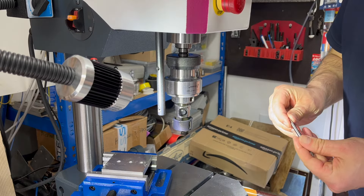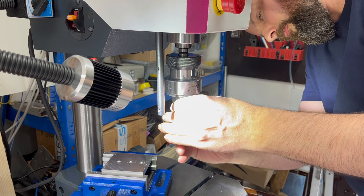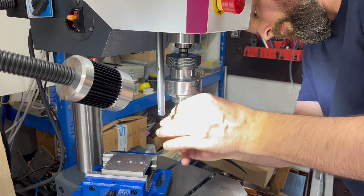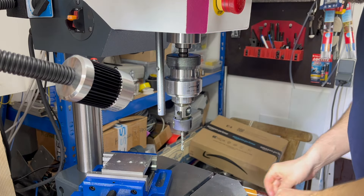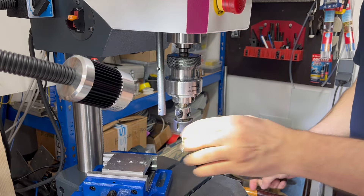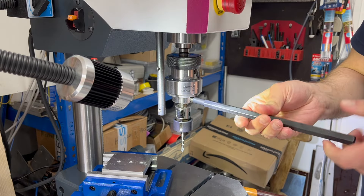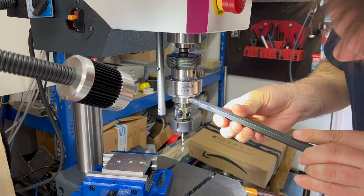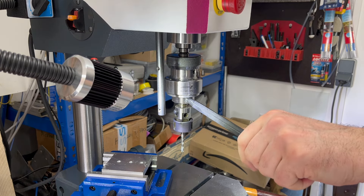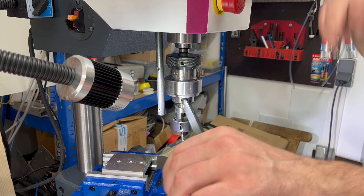Next comes the thread tap — this is a blind-hole thread tap, but of course you can also use a thread tap for through-holes, that's not a problem. It has a relatively large range: with this adapter, from M3 to M12, all thread taps can be clamped. The keys to tighten them are all included in the delivery scope. The rod, of course, is quite practical for quick changes — the rod we see here on the OptiDrill DX15V is the rod that originally serves as chip guard, which you don't have to remove.